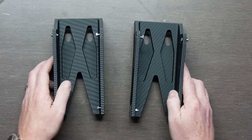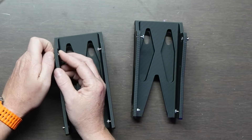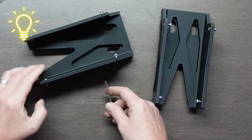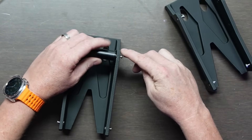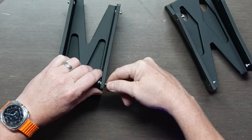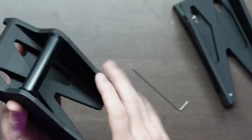Next, we're going to do the sides. You're going to have the M4 bolts and M4 nut — put the nut on the inside, there's a little spot right there for it. Put it in there and make sure it's flush all the way around, then your rollers just sit inside there. When you tighten them up, it's a very simple and cool process. You slide it in, tighten the screw, and it goes right inside that bearing. Do that on all of them — just a few to do. Get them all tightened and it just sits in there and spins.